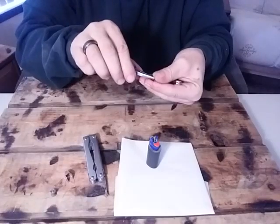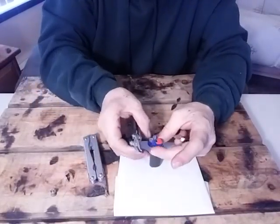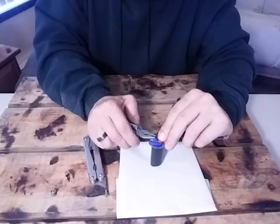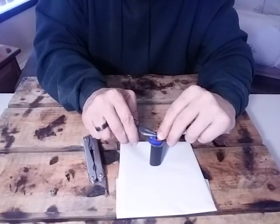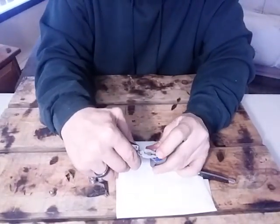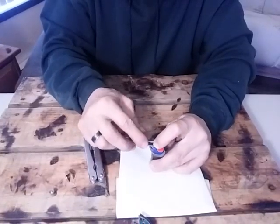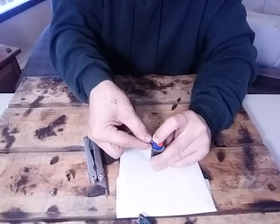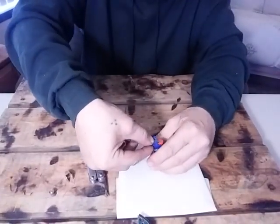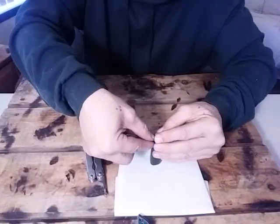We're going to get the flint prepared. With a pair of tweezers, we're going to take a pocket knife and push that spring back down. Then we're going to very carefully move the blade out of the way and hopefully hold that spring. Then we'll work the flint back down in the hole like that. We're going to take the pliers away, come back to the knife, and very carefully — so you don't poke or stab yourself — get that over the top of the flint and hold it all the way down. If I do it right, I should be able to work this right back in.